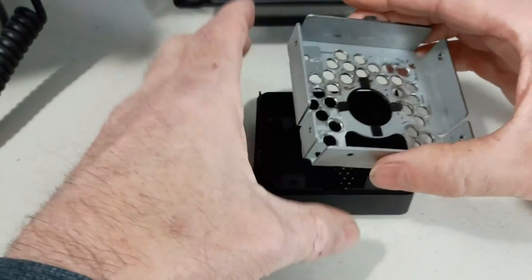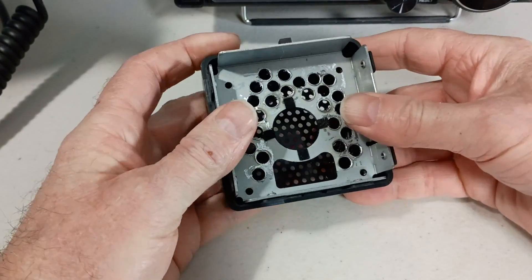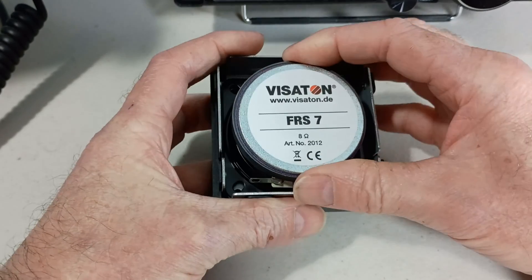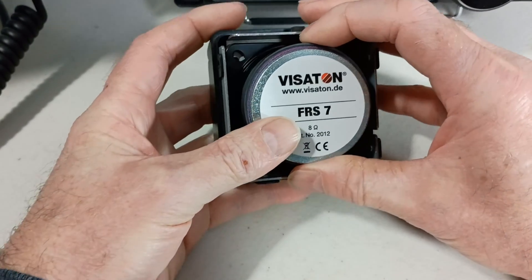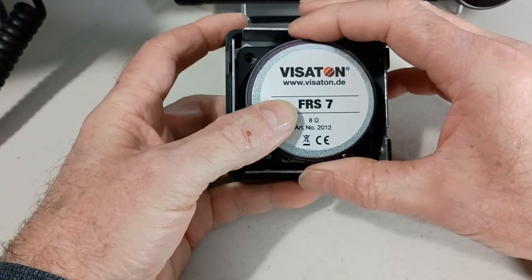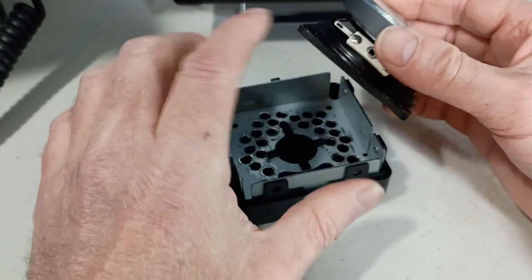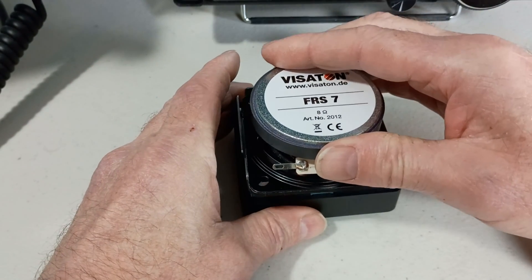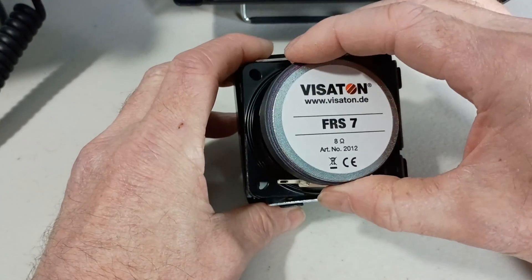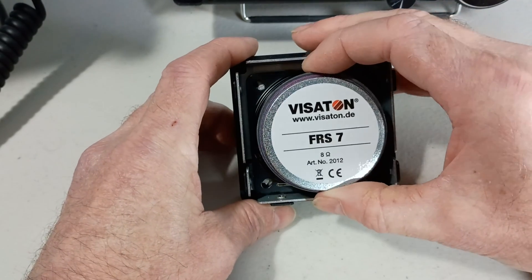What I'm going to have to do is put this in first, and then put this on the backside. These holes do not quite match up — it looks like I might have to grind this flange down a little bit so it will shift over, and also oversize these holes just a little bit.